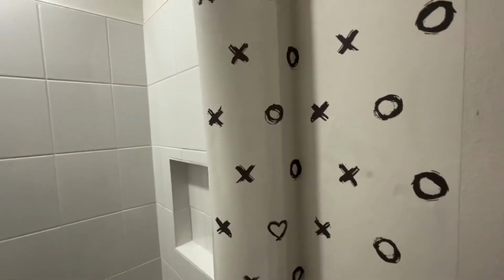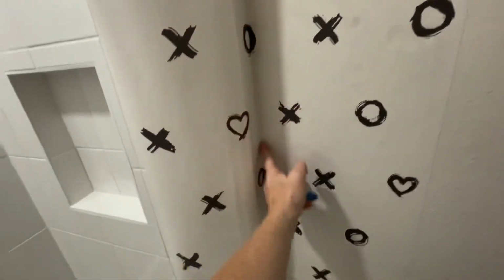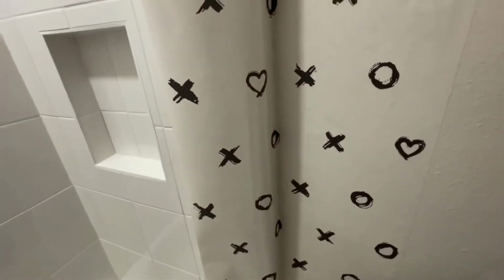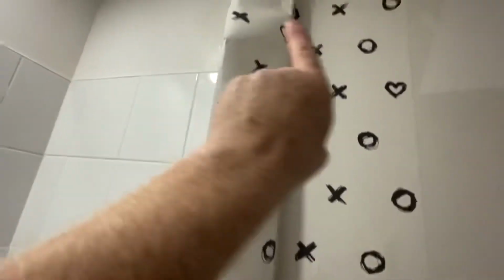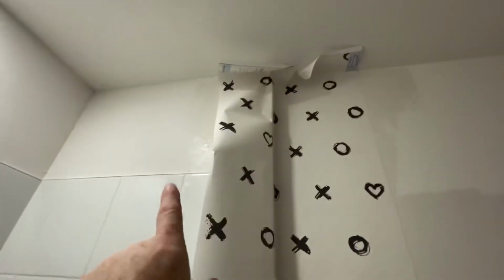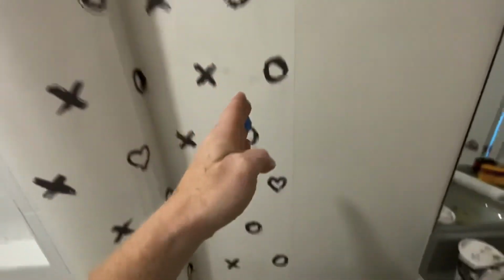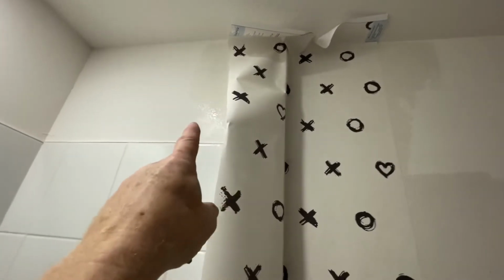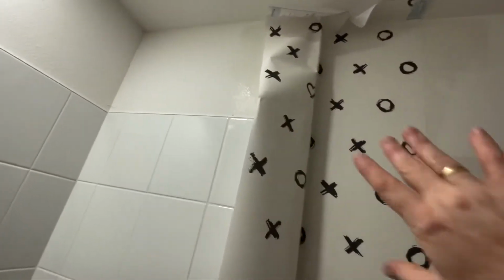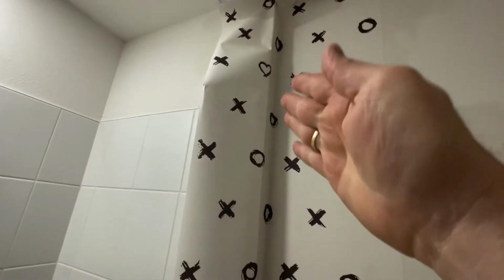Don't worry. What you're going to have to do is cut this corner, because we always cut the corner, right? Always cut the inside corner. And then, if that's off, our plumb line over here will be off. If our corner is off, it's going to affect this piece being straight. Now, wouldn't you rather have the longer piece straight, then working off of this? You see, if I were to plumb it against here, we would have a lot more crooked here. And so our piece is short over these tiles, so our adjustment won't be so significant, okay? So we made our straight line here, and then we will adjust this one and cut accordingly here.